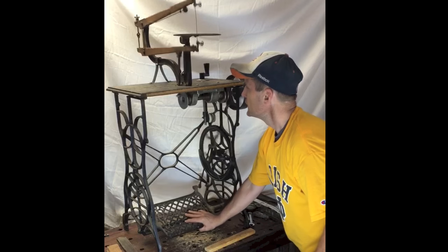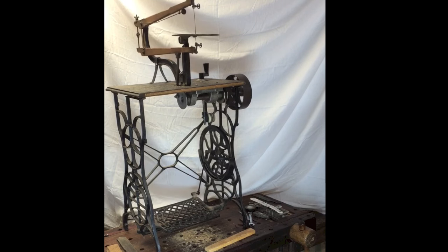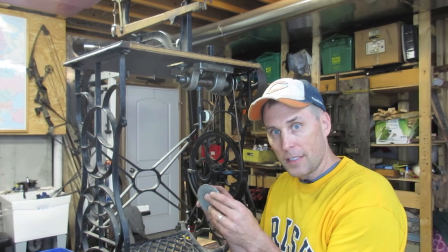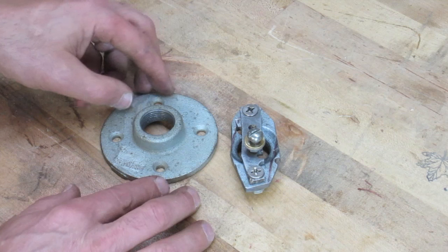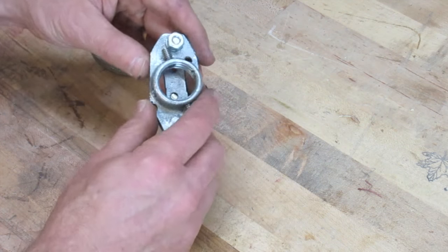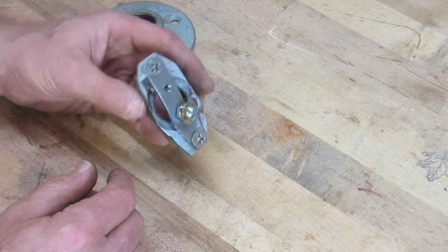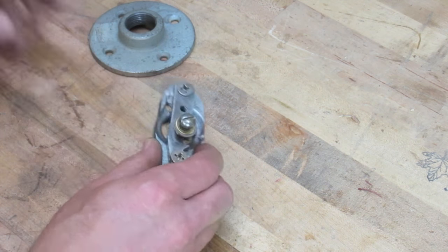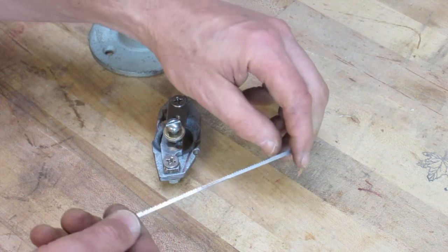At this point I was pretty excited, and then I realized my first mistake. I could only drill so close to the center of the fitting, and I ended up with a stroke that was way too long for the linkage — I put too much stress on the blade and broke two of them before I figured it out. So I took the fitting and cut off all the extra material to lighten it up. Then I took a piece of steel and mounted it to the front of the bracket, and drilled a couple of holes at different lengths offset from the center until I got the right stroke length. Instead of the blade moving up and down way too far and being unsupported and breaking, it now just moves a little bit but very quickly — and that keeps it from breaking.